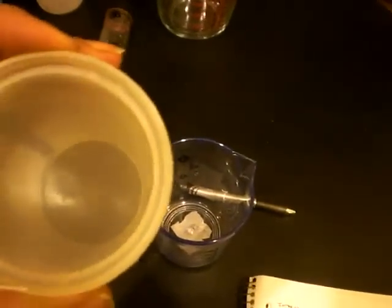As it turns out, I had one that I was actually able to calculate and verify that it was measuring correctly, because it's a perfectly cylindrical container. It has increments going all the way from zero up to about 440 milliliters at the top end, and I can use math to calculate if this scale is correct.